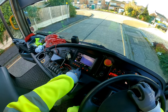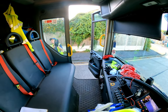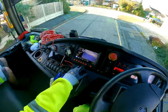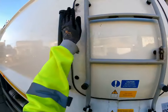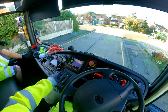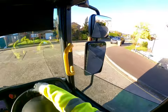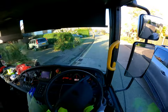So gross vehicle weight is 26 ton. About 10-15 seconds, out we get. Check again. Blade much closer now. Gross vehicle weight's 26 ton. Tare weight empty, starting off fully fueled, is approximately 13.8 to 13.9 tons. So you've got approximately 11 tons to play with.